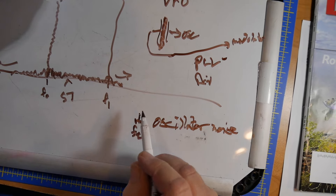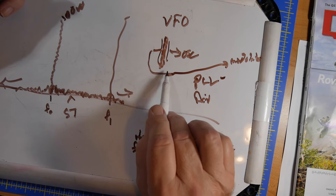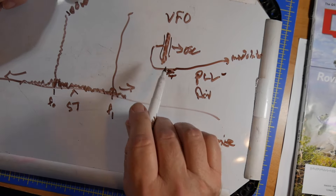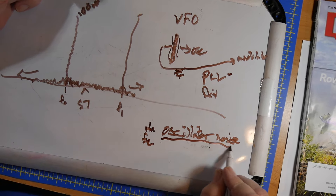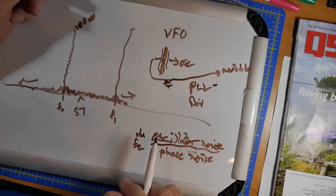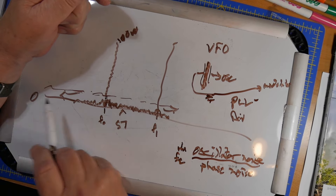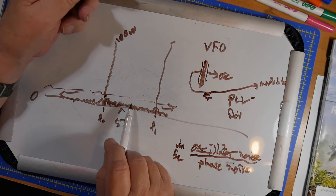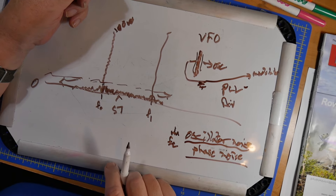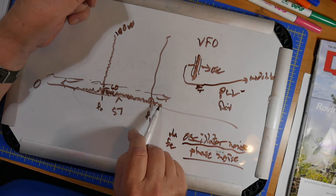What the phase lock loop does is look at this tone and compare it with the tone you want via a frequency divider. You can add a little capacitance or inductance to cause the frequency to go up or down. What you get is so-called phase noise. Since the dithering takes place at multiple megahertz, you've got this frequency with just a very slight jitter, and because it's done so frequently, it multiplies out, usually across the entire band. This is measured in QST — there's a graph for it in every QST review of any HF rig. The phase noise is usually very small, like 60 dB down or more, but it tends to be extremely broadband.